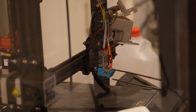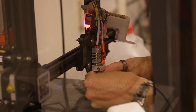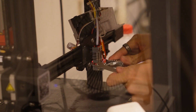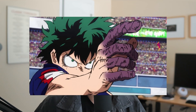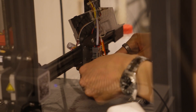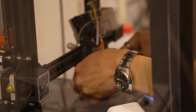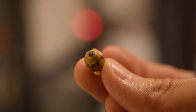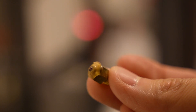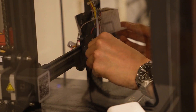Switching nozzles can be a bit of a pain. First, you need to disassemble things to expose the heat block, then heat up the heat block to loosen the nozzle, then cool it back down to remove the nozzle safely. Then you screw the new nozzle in, heat it up to tighten it again, and you're done. It's more of a pain on your fingers since the parts are small — you have to use pliers or a wrench to unscrew the nozzle while making sure not to touch anything or you might get burned, literally. I removed my old overpriced 0.4mm ruby nozzle, replaced it with the larger one, reinstalled it, tightened everything up, and we were good to go.